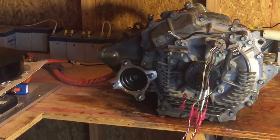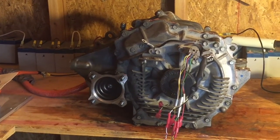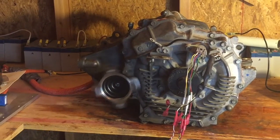You could spin this either direction, but in this clip I just have it spinning one way. It spins a little bit faster one way rather than the other, and it seems to use less power spinning it one way, probably because of the saliency.